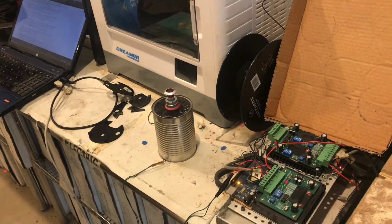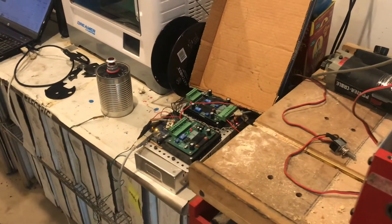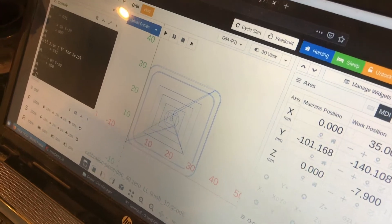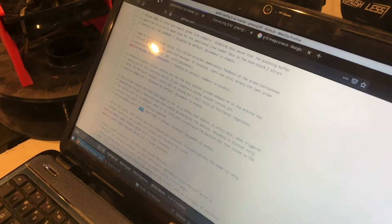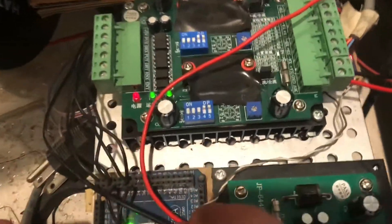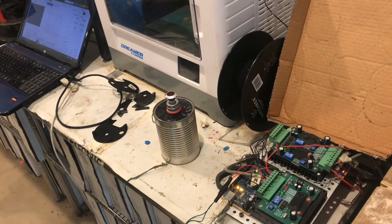With that option enabled, let's give this a go. I forgot to mention that the Arduino Mega has a separate dedicated pin for the door ajar feature, and I actually hooked it up to the feed hold. So here you see the message displayed is 'hold' — that's a standard feed hold. What I actually want is the door ajar, which is usually the same pin on a Uno, but on the Mega they put door ajar on a separate pin.